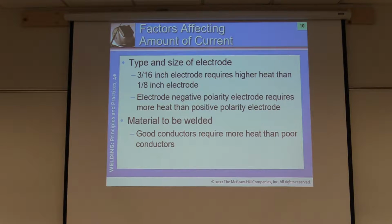Page 343, left-hand column, I want you to go about 3/4 of the way down under the bolded item, position of the weld. Welding in the flat and horizontal positions can be done with a higher current than welding in the vertical and overhead positions. We talked about this before. If we're looking at that range, the lower end is usually reserved for the vertical position. Now on overhead, I prefer to weld up at the higher side again. It takes more energy to push something uphill, to push something overhead or to throw something over your head.